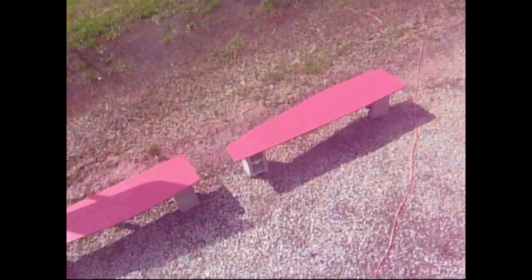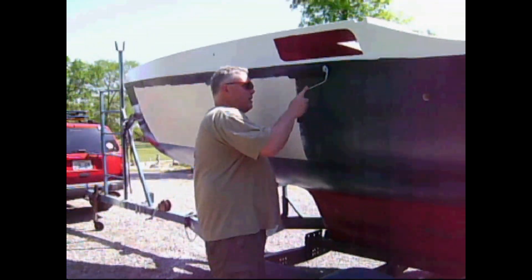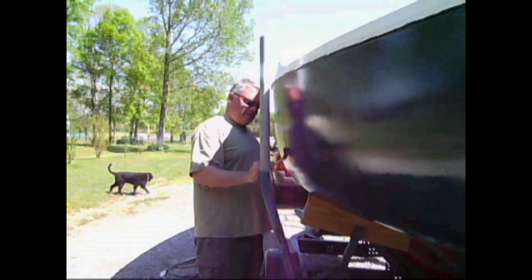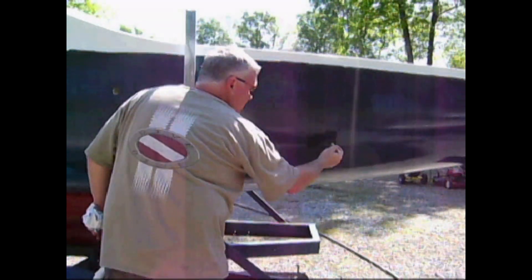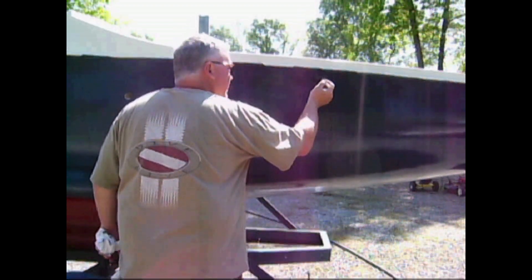The inside of the boat is finished and we're going to start painting the outside today. We'll do the top deck first in white, and then the hull will be in blue. We're going to paint the outside of the boat a nice blue color using the roll and tip method — where we use a regular paint roller to roll on the paint, and then use a foam brush to lightly tip over the top of the paint to smooth out the bubbles.